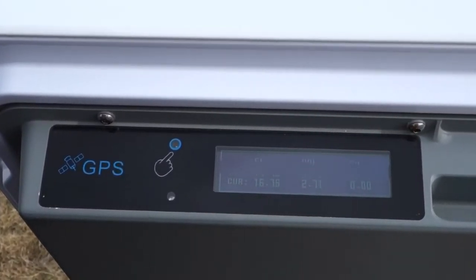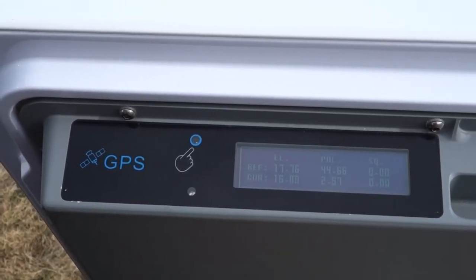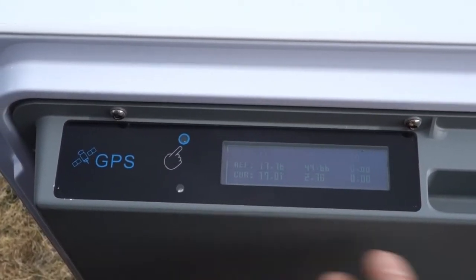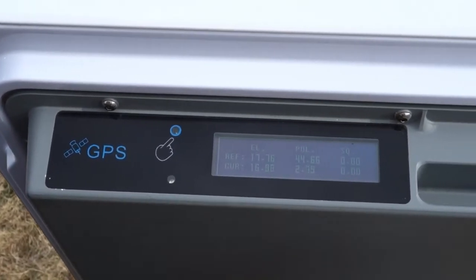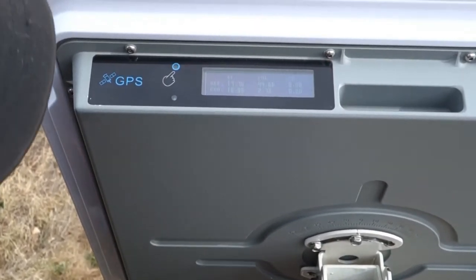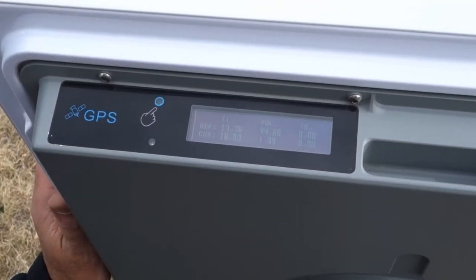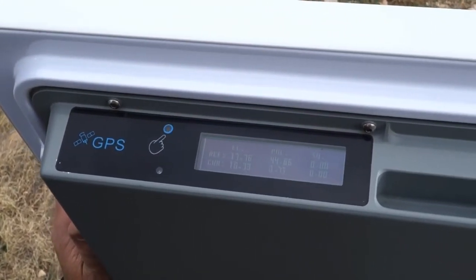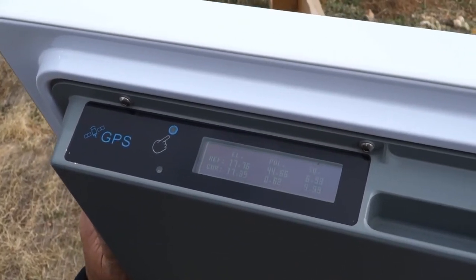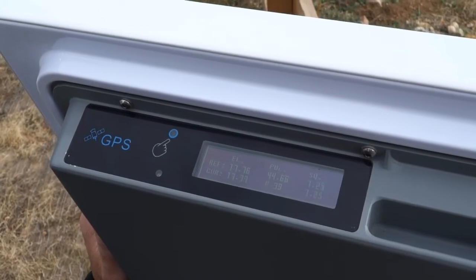On the elevation I've set the antenna elevation on the mount to 20 degrees, because that's what my line of sight tool, Dish Pointer, told me the elevation was — so I'm starting pretty close. You can be off by one degree in the rough point. From here I'm going to start doing some azimuth sweeps to try to get some signal quality — just slow sweeps on azimuth until we get some signal. And there we got some signal, which means we're locked onto the target satellite.